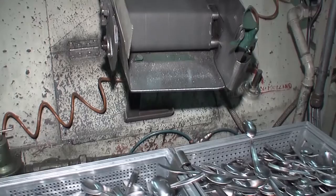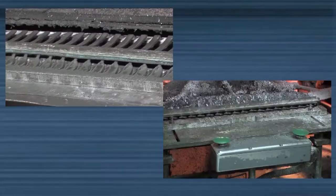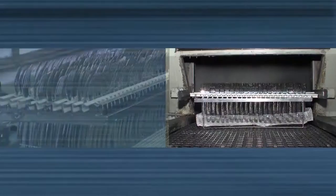Special pastes of various abrasive strengths are used to make sure that the products are as well cleaned as possible. After the cleaning stage, a careful degreasing with water and detergent, and a rinse with distilled water guarantee the maximum level of hygiene of the treatment.